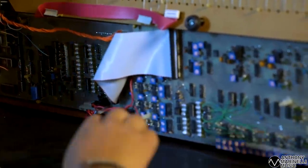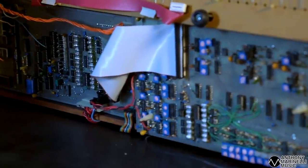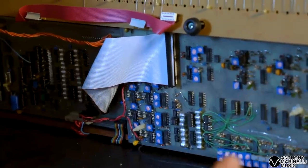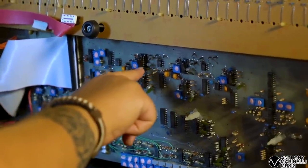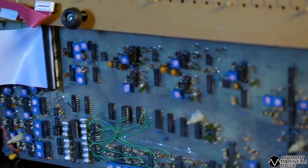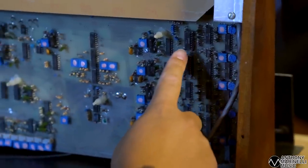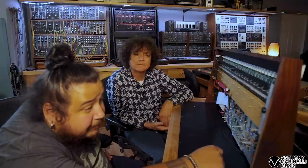Where are the oscillators and the filters and the VCAs? These are the envelopes - the SSM 2050, though they may be marked differently because they had chip fabs back then. There'd be ten of those - five for the filter envelope and five for the amp envelope. Over here you have your oscillators, the SSM 2030, which have a goopy kludge on top with a resistor and under that a temperature compensating resistor glued to the top of the chip. Towards the right you have VCAs that feed the oscillator level into their respective filters. The filters are the SSM 2040 - a very revered filter with very hot resonance. And then after that you have your VCA, which I believe is based on the SSM 2020.